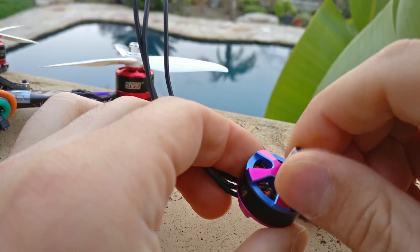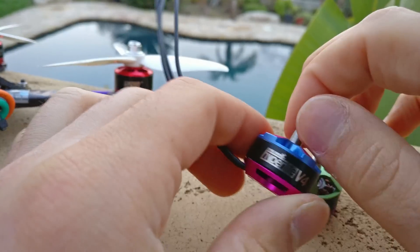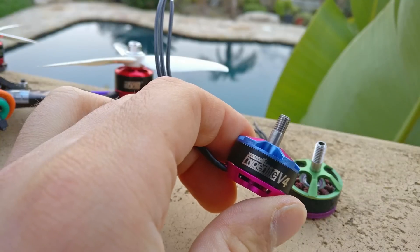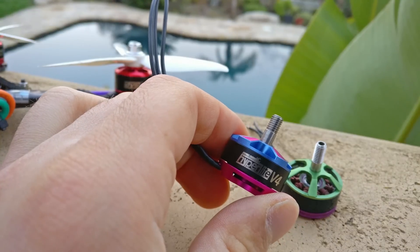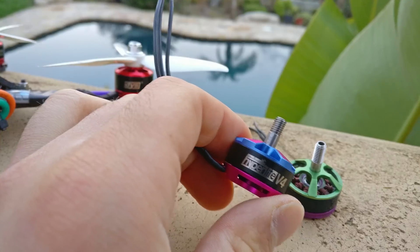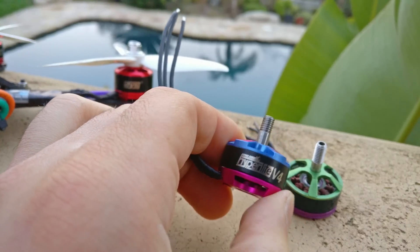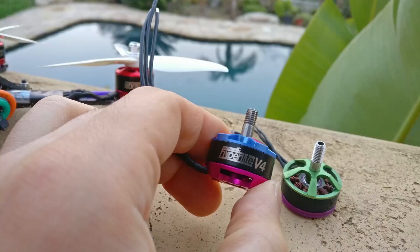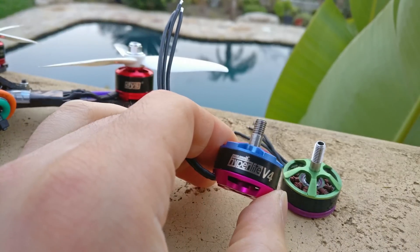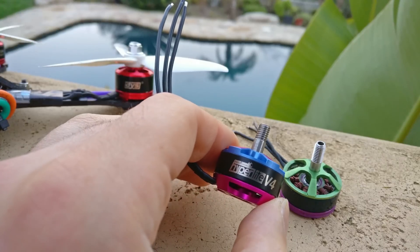The stator is made up of layers of metal that are highly magnetic, very ferrous metal — probably an iron-type material. They are very thin laminations. When you look at the lamination thickness of a motor, that's what it's referring to. This is all just stuff I've gained over the past year of looking at things and numbers.